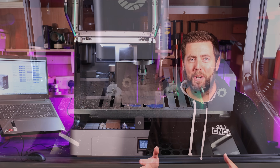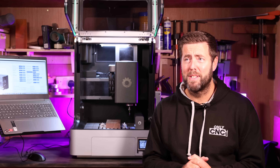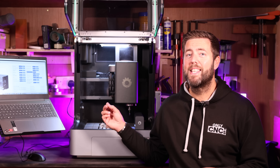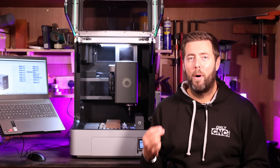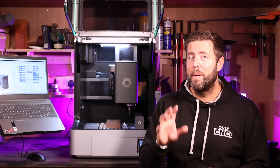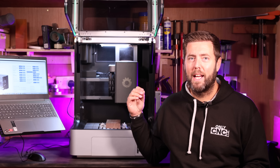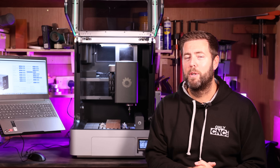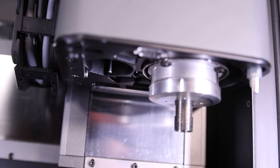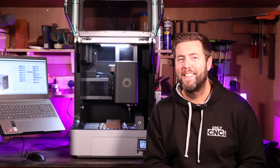Moving on from the work area, let's talk about all three axes. These are running on linear rails ball screw drive system with closed loop NEMA 23 stepper motors. That is pretty impressive, and if you're not familiar with the term closed loop, it is critical because what it actually means is that it is feeding back to the machine as it is running, so it can monitor it much more accurately in terms of its position, what is going on, and any pressures that may be being put on the stepper motors. Everything is fully enclosed so none of the debris that you are machining is going to get close to those components. At the heart of this machine is an 800 watt brushless spindle with a range of up to 18,000 RPM. I'm also pretty sure this is a closed loop spindle but not 100% sure, so I will try and confirm that in the next video.